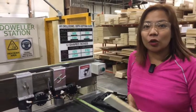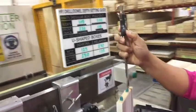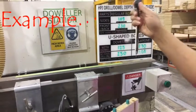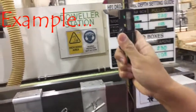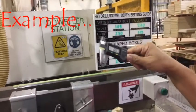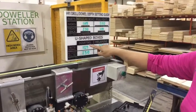From the SOP I've also included the requirement. For the visible dowel requirement, it's 9 to 10 mm. I've set up the machine based on this setting, and when we check here with a caliper, we get 9.05 mm — which is within spec.